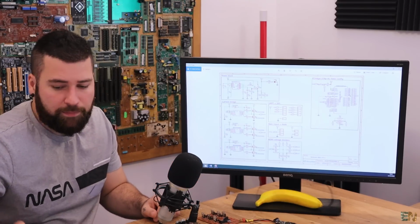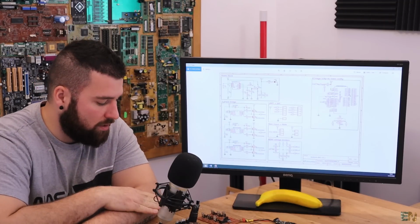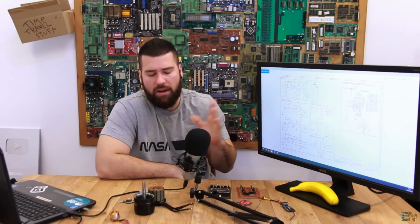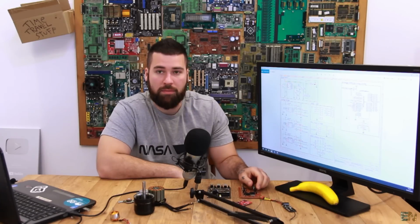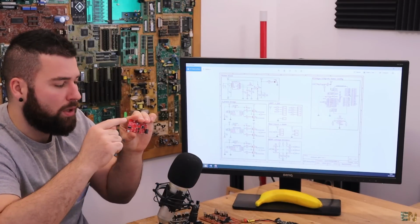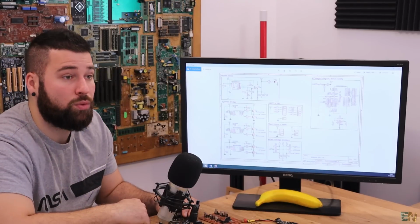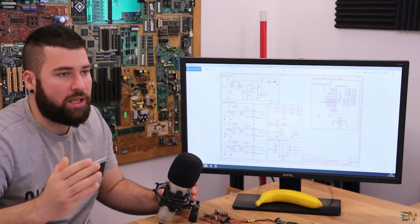improving this schematic. The last part of this is the future improvements that I want to make for this ESC. The first one is to add a potentiometer control, and that is very easy. It's a lot easier than controlling with the PWM signal, because all you have to do is add a potentiometer input. Maybe for the fourth version of this ESC, we'll have a separate pad, and then we can connect a potentiometer to that pad. And by reading the analog value of that potentiometer, we can change the speed.